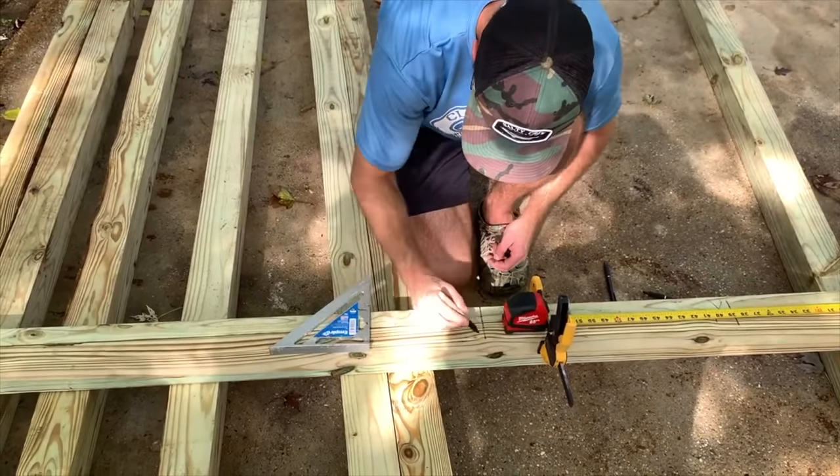So after lifting the wall into place and installing the siding, we can start preparing the window for installation. The first thing you want to do is take some flashing tape and install it on the bottom of the window's rough opening so that it overlaps on both sides, and there's also around a 2-inch overlap over the top of the window's sill.